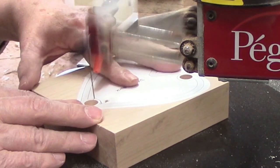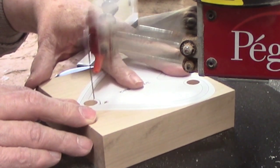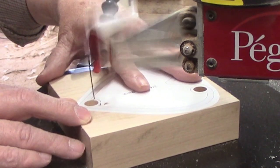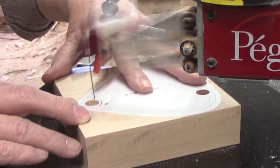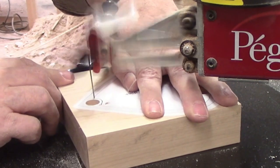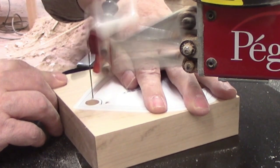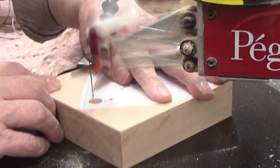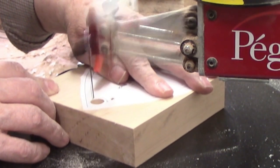Anyway, this was one of those times when the blade would not go all the way to the corner. That's all right, the technique still works with a slight variation. If the blade won't back all the way into the corner, just move it as far as it will go into the blade's kerf, then start cutting in the new direction from there. This is going to leave a small area that you can go back and clean up later, as I will have to do here. That is done after the inside cut is completed and the waste piece is removed.